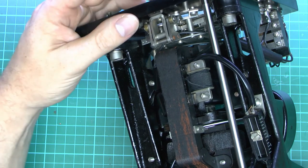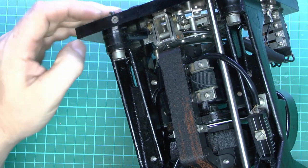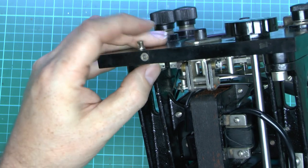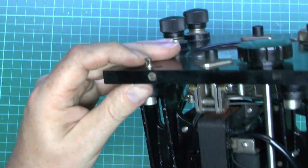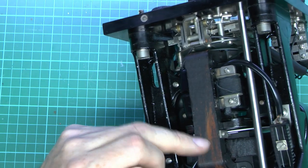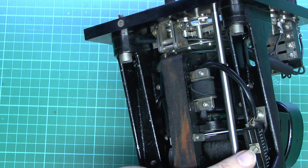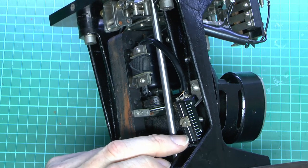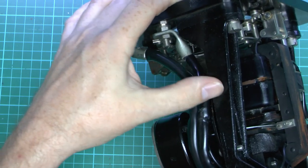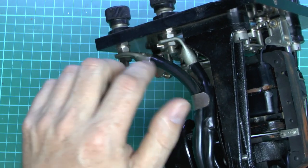This is a view of the back. Here's the other reset button — as you press that, it just moves that mechanism to zero those pointers at the top. That other little thing on the top there appears to be a sort of tying-off point, possibly some sort of calibration lock or something similar. It doesn't actually go through to anything, so it is just a metal post in the top with a hole through, and a little hole next to that. On the back here we've got this laminated core, which is for the actual metering part. And you can see some of the other wires coming down to this piece, which is marked between F and S — so extremely fast and slow — some kind of adjustment or calibration item there.